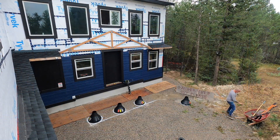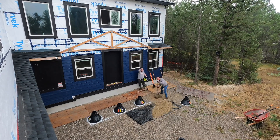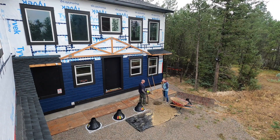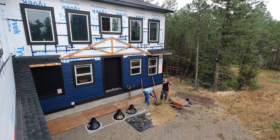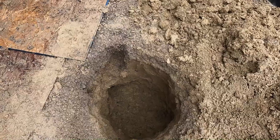My friend Eric and I have four piles marked out with white paint. We'll use this 40-volt, 8-inch RYOBI auger to loosen up the earth. We are digging a 28-inch diameter hole, 4 foot to 4 foot 6 inches deep. I'm using a 10-inch form tube and a 24-inch Bigfoot. After pouring concrete, I'll embed a 6-inch by 6-inch saddle to hold the post. The spacing is just over 5 feet apart.